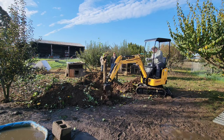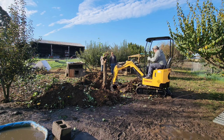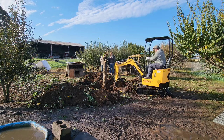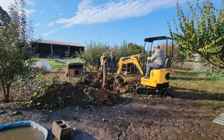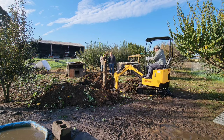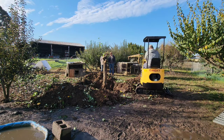During the recording of this video, this is in November of 2023. So this style right here, it's all steel construction, and it's a very simple design. You have a motor in there that runs a gear pump. You have a small hydraulic tank, and it feeds a valve bank that your levers are hooked up to, and those actuate either your tracks, your blade, or your bucket.